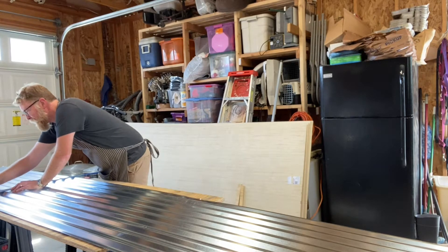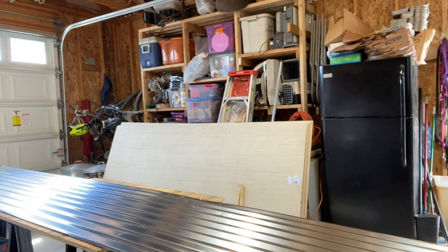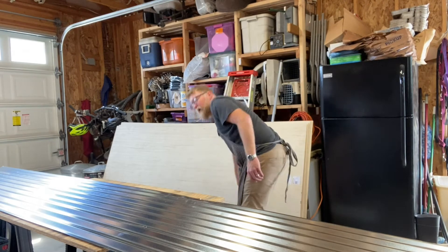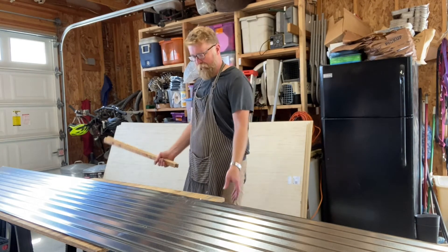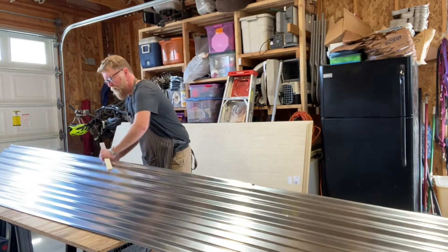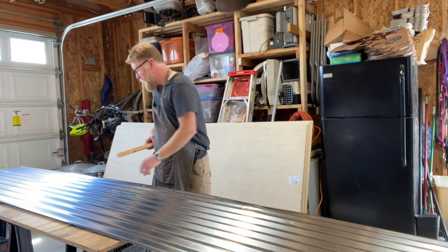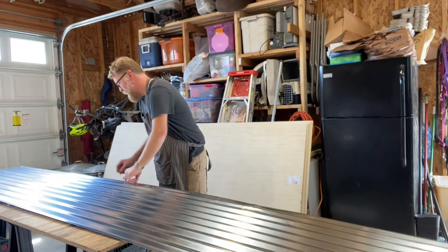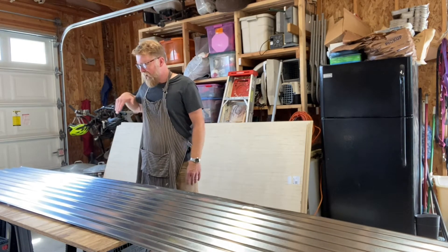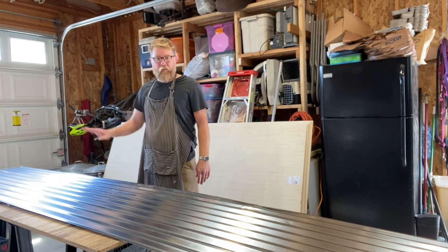Actually this is working out really well — the shears cut a nice smooth line. I'm cutting some little plywood stickers that we have laying around, just to bring up your material where you're going to cut, just bring it up off the table a little bit. That allows the bottom little nipper of your shear to get underneath and gives you lots of room to cut.